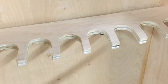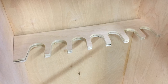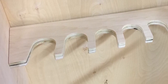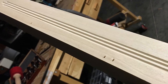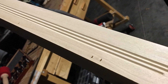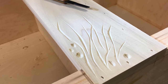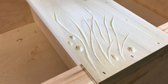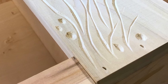Pay sometimes to just push your envelope and try something — it doesn't matter if you mess up, you just get another piece of wood. Here's the top chamfer, and that chamfer is just because it looks nice. This part took some thinking too — this is for the barrels of the guns inside the case, so you have to get the width right, the depth right, and then make uniform cuts. I think I used the bottom of a can of paint to get the U-shaped portions and then just took my time and cut them out with a handheld jigsaw. This was another bit of fancy but it's really easy — I have a router on a router table. You use a router bit, put some stop blocks on, lay the piece down, cut one slot, move it, cut it again, move it, and cut it again.